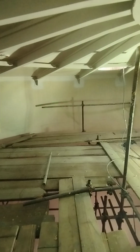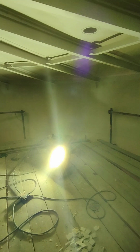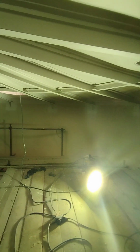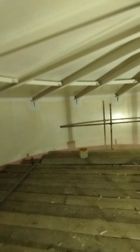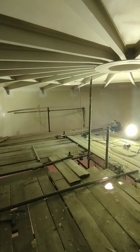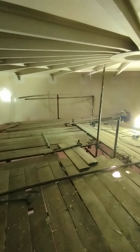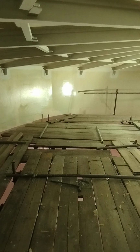So what happened was that the quality of the water, which has to be about parts per billion of iron oxide, would finally be reduced to around ppm, or parts per million. So the point here is that when we are designing a storage tank, we have to carefully take care about the material that we are using and its relation to the stored product.